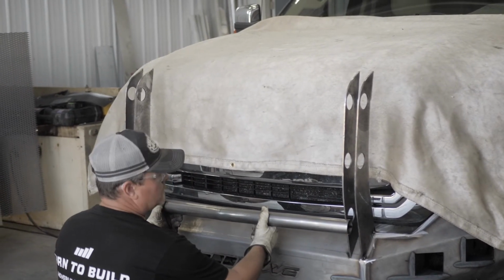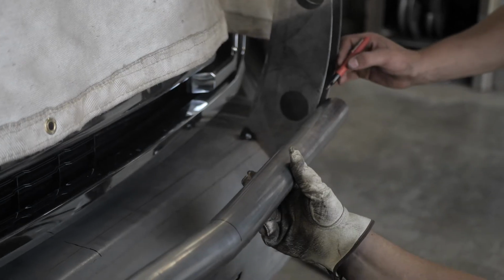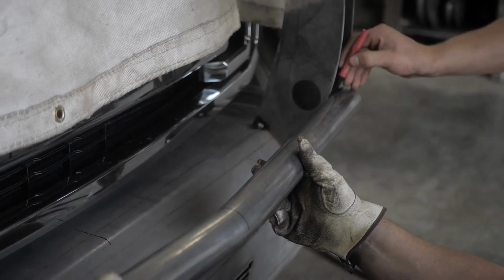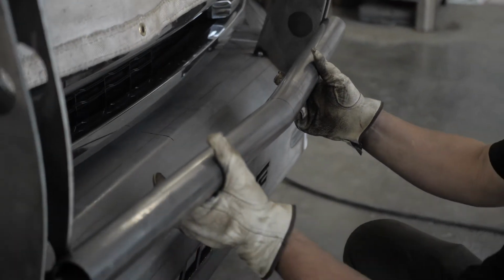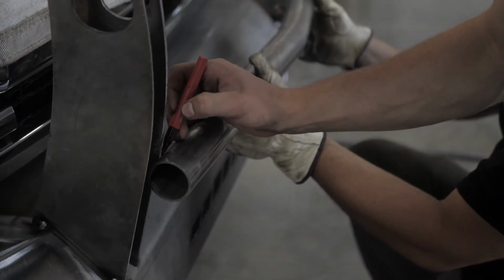Per your preference, place the center bars center or level to the truck and tack into place. Then, fit your wing hoop to the W2 protrusion hole, as well as your upright protrusion hole, and level to your headlight or fender. Trimming may be required.